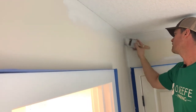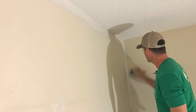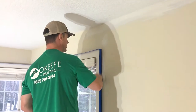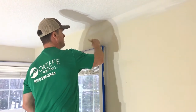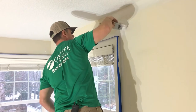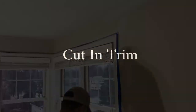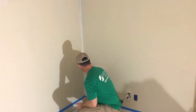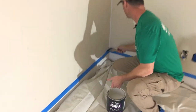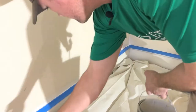The person cutting the ceilings is also going to cut the walls into this corner. This spot is dry, so I'm going to spot prime the holes that we had filled earlier. It's nice to be able to get all those areas spot primed so they don't flash off, especially since we're using quick-set mud which doesn't take paint the best. That's why we have the tape down. We're really only worried about this bottom edge — we want to get that edge so we go over it a couple of times.